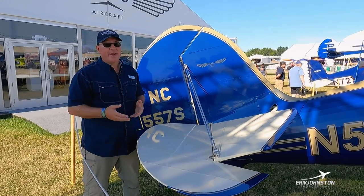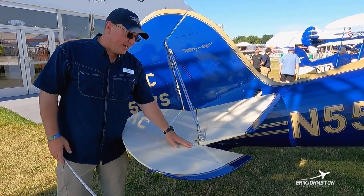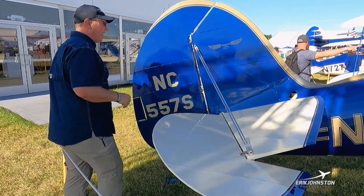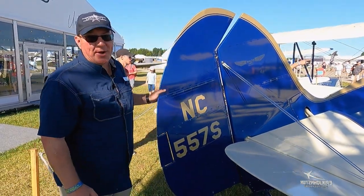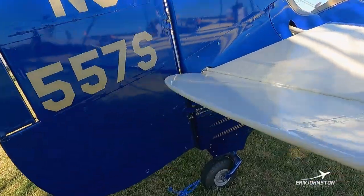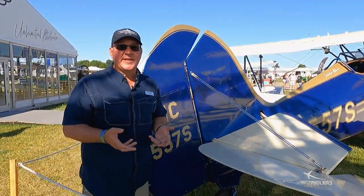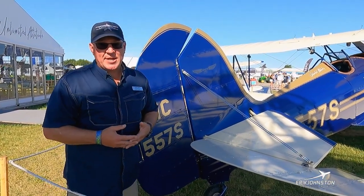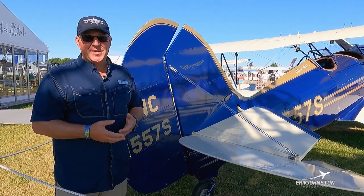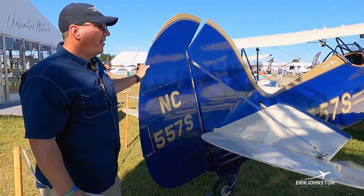This aircraft is very light in the ailerons, maybe a little heavier in the elevator — a very positive elevator feel. They are counterbalanced elevators, giving a good strong solid feel. The aircraft has a big rudder, which helps a lot when landing. Regarding the tailwheel: this one is steerable or it casters. When we push it backward into the hangar, we disengage it for free castering. Otherwise, we can taxi, take off, and land with the tailwheel engaged in steering. That steerable tailwheel coupled with the big rudder really helps the aircraft on takeoff and landing — it's very effective.